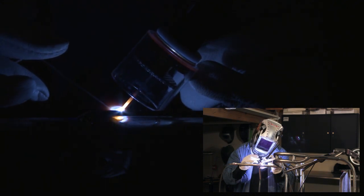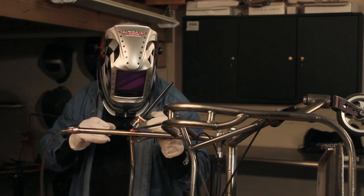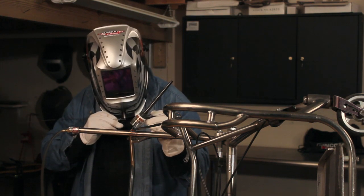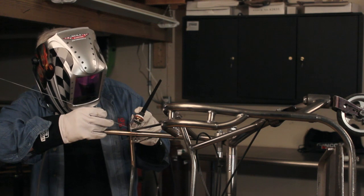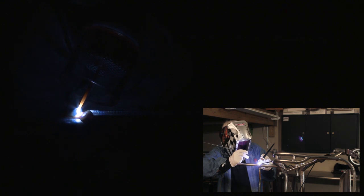This is the ATR. A little pre-flow of argon — same thing. I'm adding some filler; it's welding up pretty good, got a few contaminants in there but not bad at all. Good positioning. I'm getting out of position, so I'm backing off. Everything is cherry red right now, but because I've got the argon flowing I feel pretty comfortable that the weld is good. Now in the final phase — just a little wrap-around touch-up, making sure I get enough filler on the tube portion.